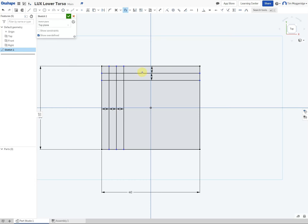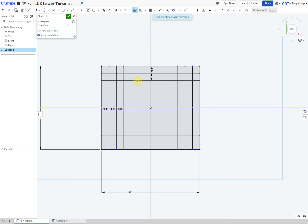At the top I only need the two lines. Now I am going to use the mirror tool. For the first mirror line I am going to use the edge of this work plane, and select the three parallel lines that I added in. Then unselect the mirror line and select it again. This time pick the other work plane edge and select the two lines there.